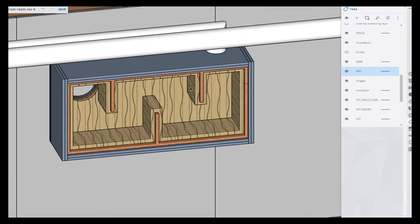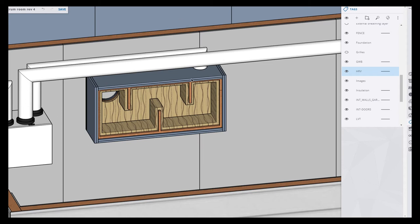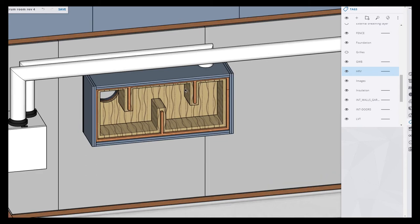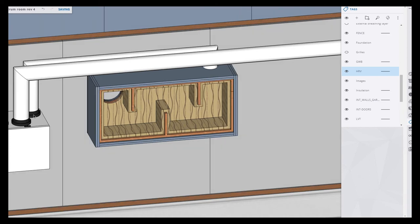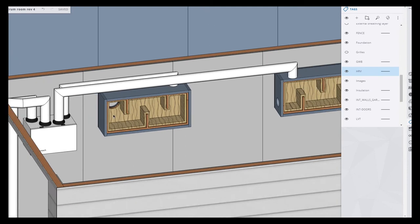The idea is that I want to have a device that helps maintain the barrier between inside and outside. In HVAC, one of the very important things governing noise has to do with what we call velocity, or duct velocity. If I had a huge duct, it'll be a lot slower and less noisy. But you've got to remember, how do I physically install that? This is a garage with physical limitations in terms of space, constructability, and some of those other things.